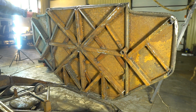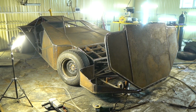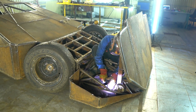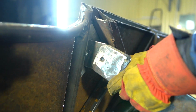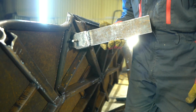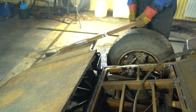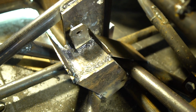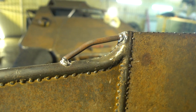We also have to completely re-weld the lower part of the splitter as the lid is only held on one pipe and will definitely bend after some hit. To mount the lid in a certain position we'll weld a pair of fixators to it. There'll be the racks on them. I made them mobile, they'll be folded while closing. Such height will be enough to fly over the wheels. The struts will stand on special stops and be fixed with linchpin. We can make automatic lifting in the future, but during the tests we'll lift everything manually.